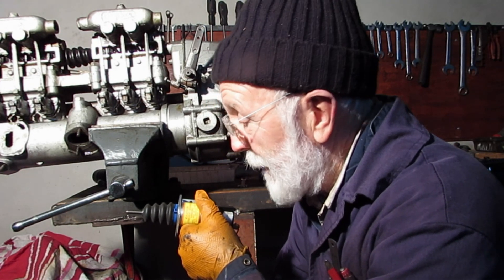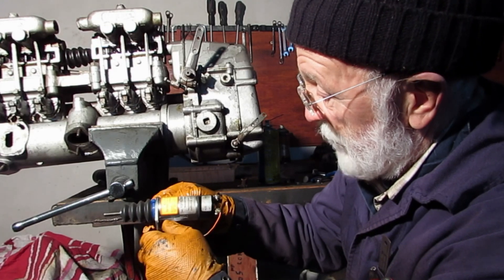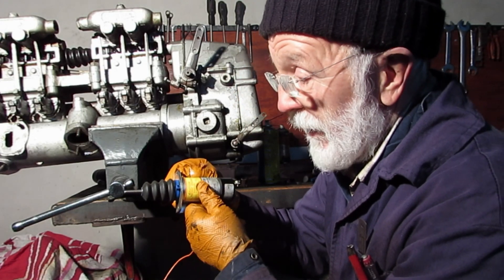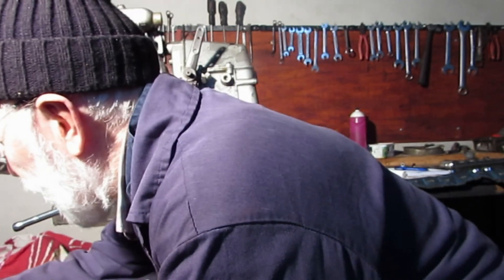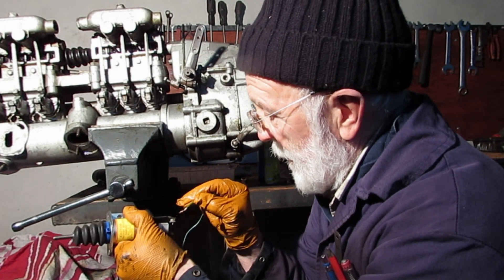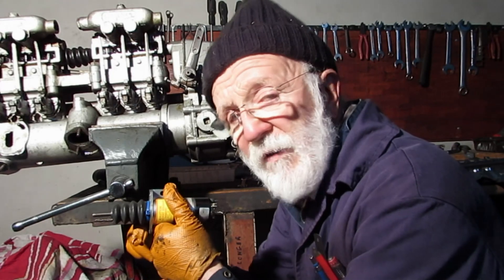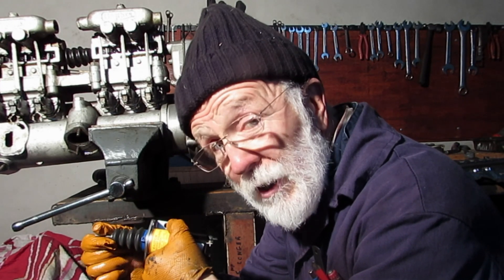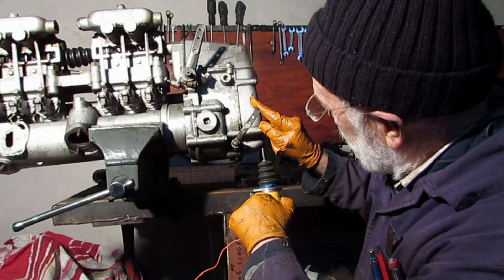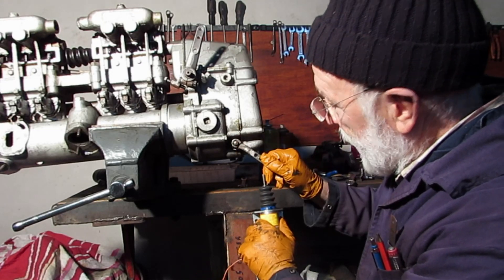As you've probably guessed already, yes, we can use a solenoid. Very simple. Here we have a low cost, very simple, very rugged, quite reliable little solenoid, and it'll do the job for us quite well. If I supply it with electric energy and switch it on, it'll pull in. And I think you can tell, even by that quick demo, that that pull is actually quite strong — it'll apply quite a lot of force. So in this case, we've positioned our strangling lever there, and if I mount my solenoid there, it'll pull the lever down, no problem.